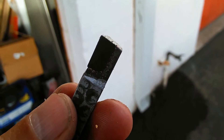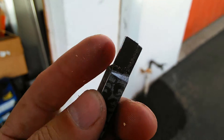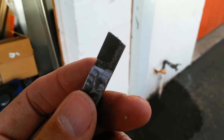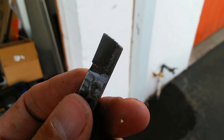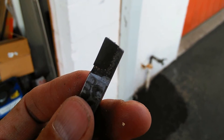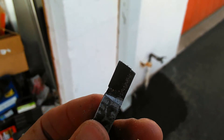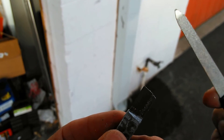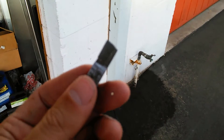You've got to mind your tool speed, the direction the bit's cutting - sometimes you forget and cut in the wrong direction, causing chattering and dulling that edge. As long as you're using the tool the way it's supposed to be used, you're going to see good tool life. And if not, you've got your dollar store diamond-impregnated nail file. Thanks for watching.